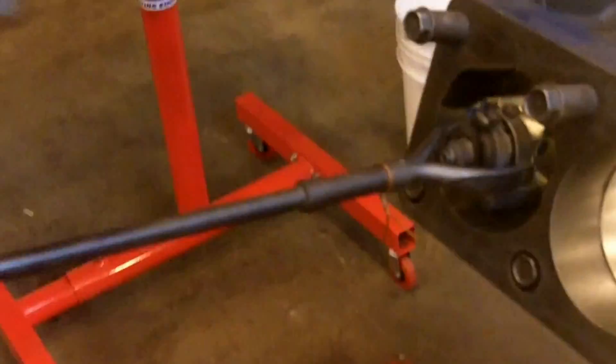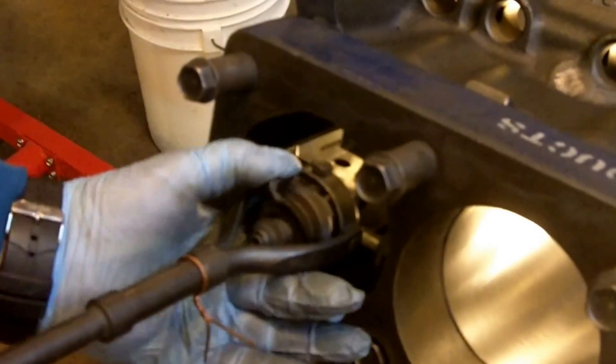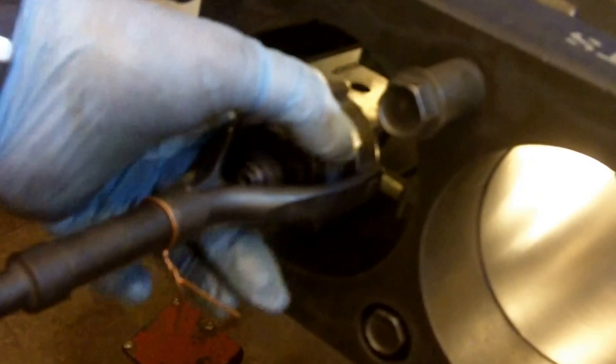The copper wire is a little bit below this surface. So when we hone, we don't want to hone any farther than that. If you go too far, you hit the web. So we got it in there now — you use the fine adjustment to bring it out. It moves fairly easy until you feel some resistance.